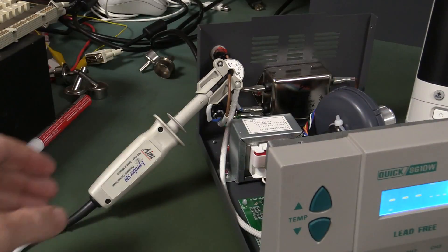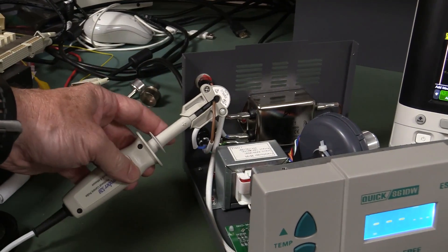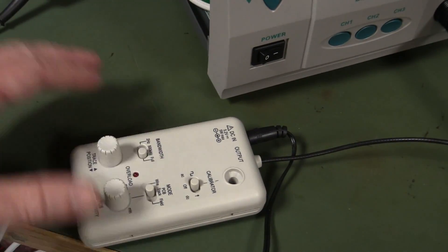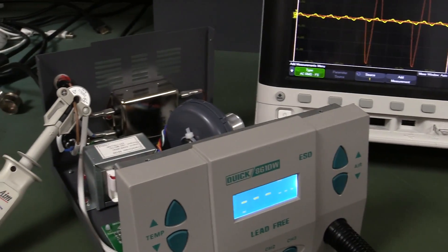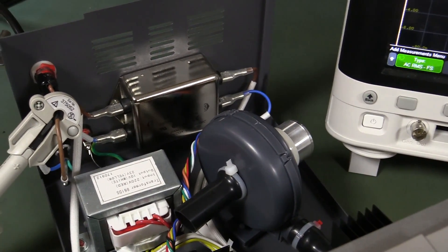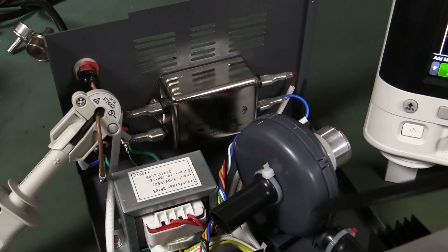Some people wanted me to measure the waveforms, so let's look at that. I've got my AIM iProber 520 — a very nice piece of kit — with the clip-on toroidal attachment, which lets me use it as an oscilloscope clamp meter to view current waveforms. The sensor and amplifier give a nominal 1 volt per amp output. I've got that hooked into the scope on the primary side of the filter, and I also have a reference waveform captured from the secondary side of the filter.